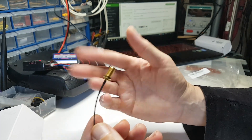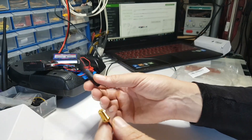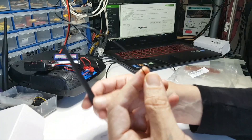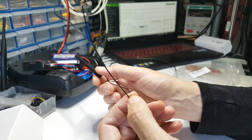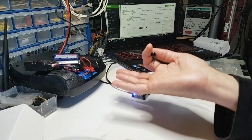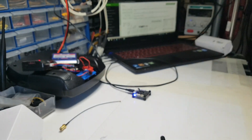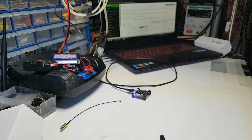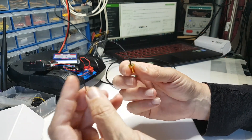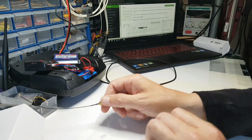Because this cable has too many losses in it. You need a thicker coax — you need an RG316 type coax, rather than these really thin ones. They're fine for no-gain and 3dBi antennas, but if any of you are out there using thin pigtails with 5dBi antennas, you're probably going to run into issues. You could actually damage the output on the transmitter side of your transceiver — technically it's a transceiver, but let's call it a controller to keep things easy. So if you've been trying to use the 5dBis and running into issues, that's the problem. Too much gain through a little tiny cable, throwing it out of balance. It could actually damage your handset, so keep that in mind.